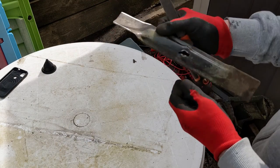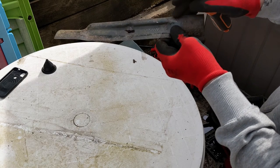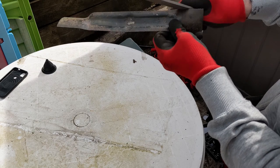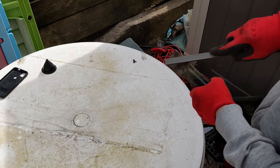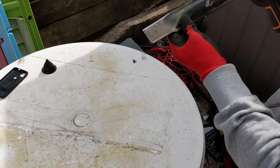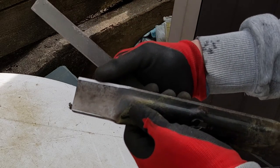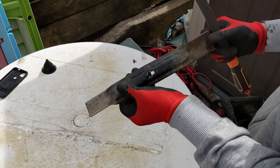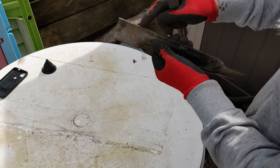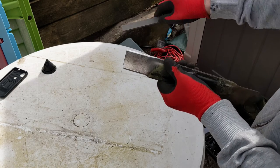So I've done that side now. If you look at the other side, there's a lot of dings in it. The first thing I did was to file it down just to get it straight and get all the dings and dents and grooves out of it, and then went at the right angle. It seems to have come up pretty good. Again, you don't want it razor sharp, because if it hits a stone or a stick, it'll put these dents in there and blunt the blade much quicker. So you want it sharp, but not razor knife sharp. I'm just going to do this side now.